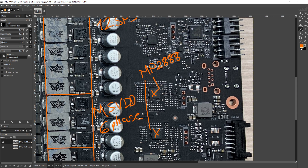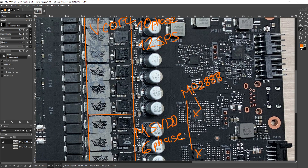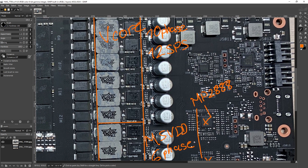The MP2888s are fully digital. They go up to crazy high switching frequencies — literally one of the best controllers you can get on a 3080, 3090, or 3080 Ti. These are supported by the Elmore Labs EVC2, and I think you should be able to change everything because they are supposed to be fully digital controllers. That means LLC control, switching frequency control up to completely impractical frequencies. I don't know why Monolithic Power Systems has a multi-phase controller that goes up to apparently 10 MHz switching frequency — I'm not aware of any power stages that would support such a high switching frequency, but apparently it can do that.